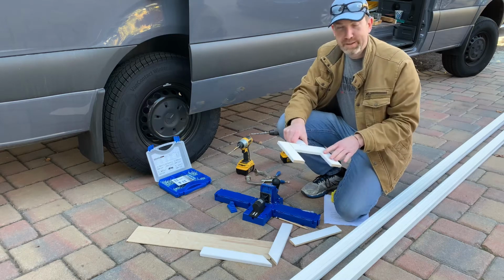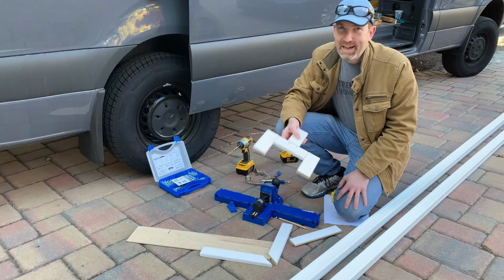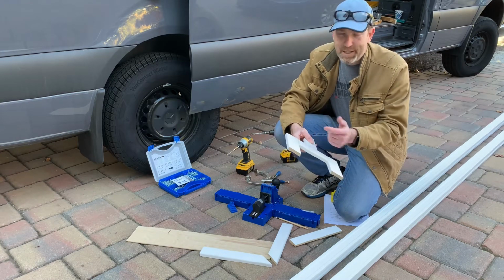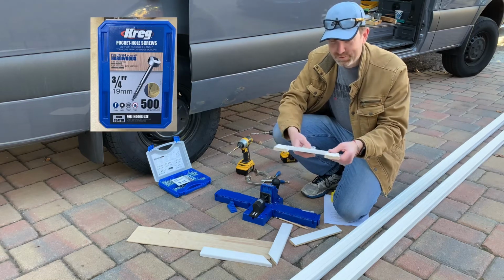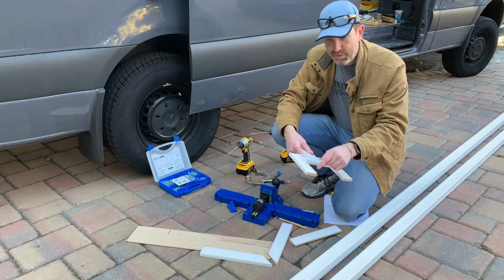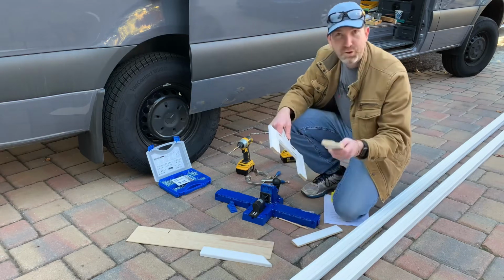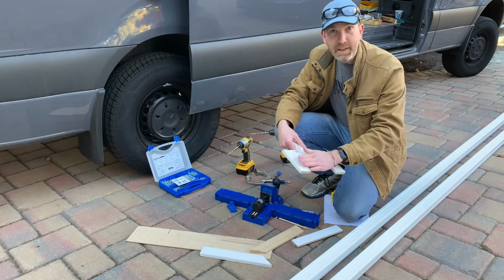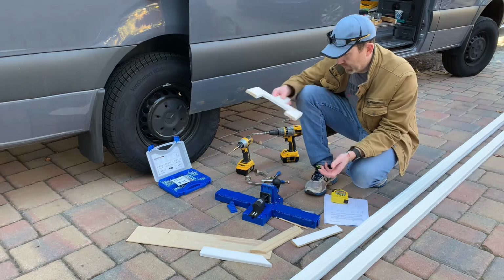Essentially, you cut your wood and put it together. This is just my experimentation. I thought I might need screws shorter than 1 inch, and I do, otherwise they come through. So I ordered some 3/4 inch and I'll get those soon. In the meantime, I can cut all my wood, and after you cut it, you take a router and route the inside to create the same shoulder that'll house the 1/4 inch plywood, and then you nail it down, and then I paint the whole thing. So it makes it really simple to do.